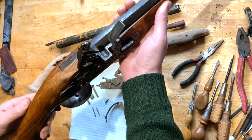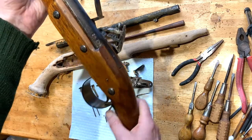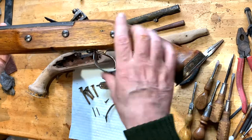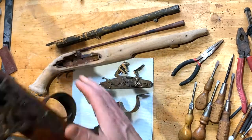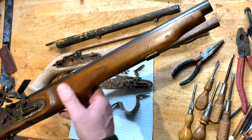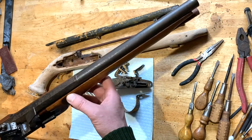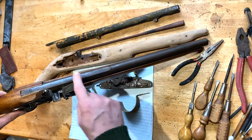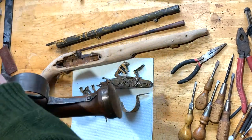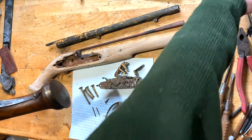It's all been stained and oiled and sealed and burnished, and it has a nice looking effect. All the screws look right. The pins have a little bit, but they're not always, because you tend to burnish that off. Now, at point of delivery, you may wish to burnish a bit of this, put a bit of natural wear where you would naturally have wear. You can put a bit of wear naturally there and across here using a bit of 5-0 wire wool.